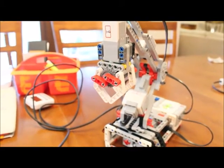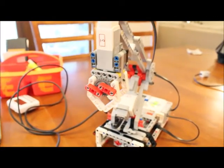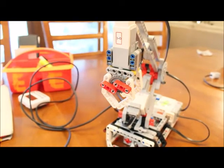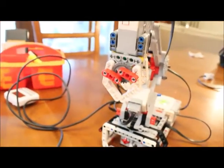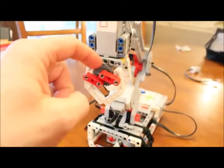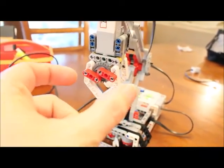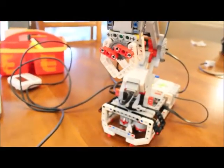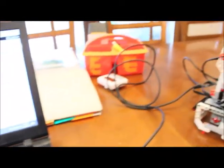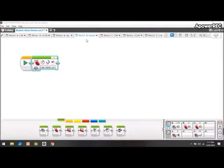It ran — you saw that it opened and then it closed and then it stopped. Now I'm going to run the motor A counterclockwise program again, but this time at a negative 10 power and again for 180 degrees. The gray wheel now needs to go clockwise to open the clamp; once it gets halfway the clamp will be all the way open, and then it will start to close again. Let me hit run.